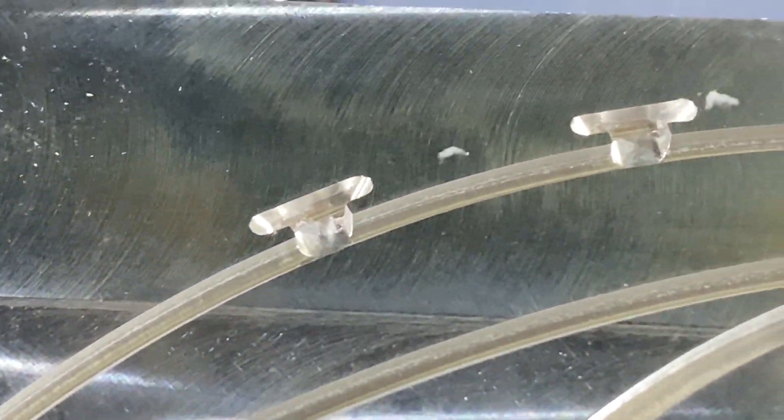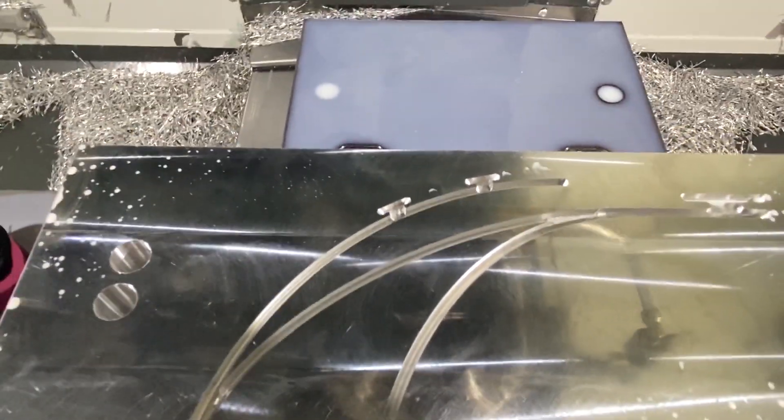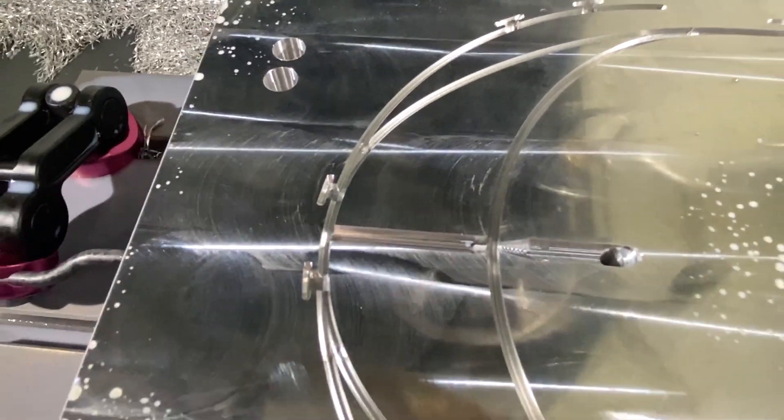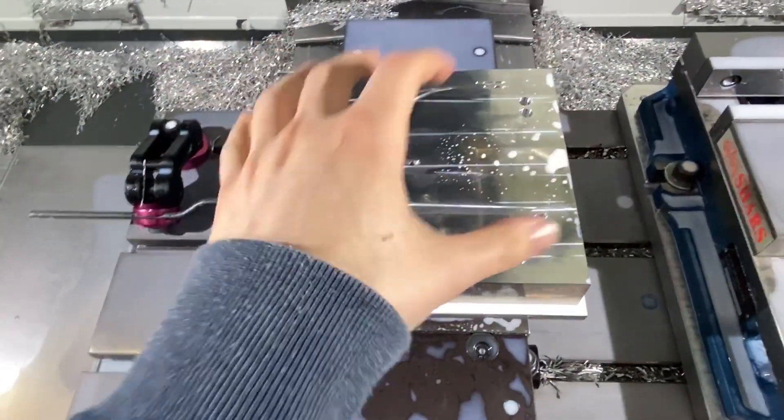There's the cavity — it looks rough but honestly it looks really good. I did a sixteenth inch ball, one thou step down and step over. I've got to do this side and then this side of the mold is done.